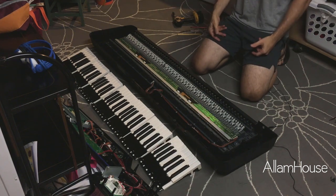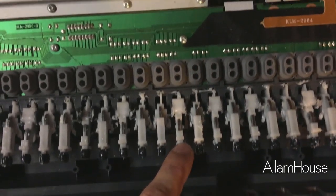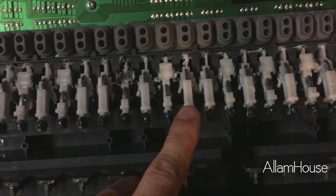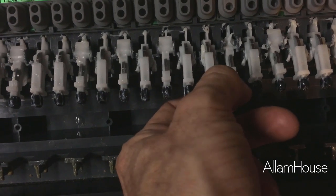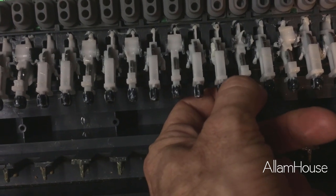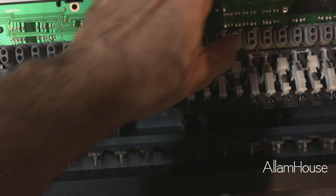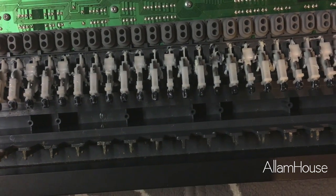There's our keyboard. If you look up top these have a little cap — the pivot is right in the middle. As we come down they all have that pivot, and right here you can see our broken key. That's the weight and how it's broken — that piece just somehow got snapped off. We've got to get that out, and to get it out it's all routed underneath, so I'm going to have to take this board up and pull it off to get to that key.